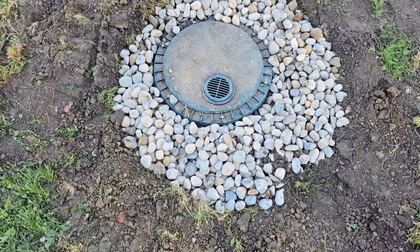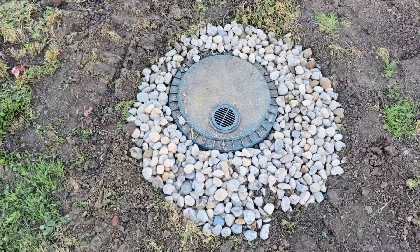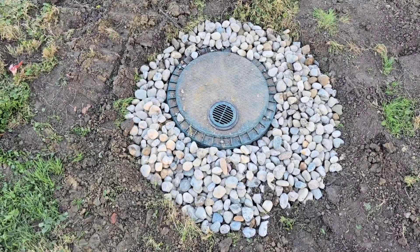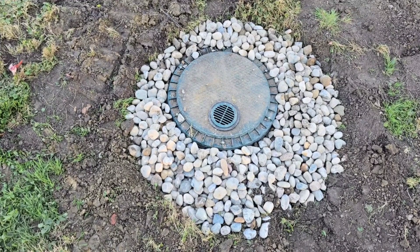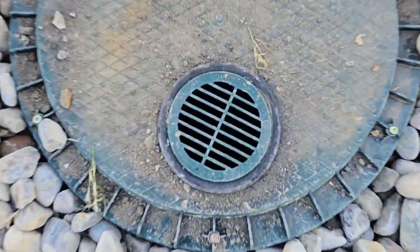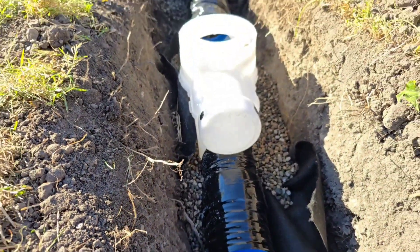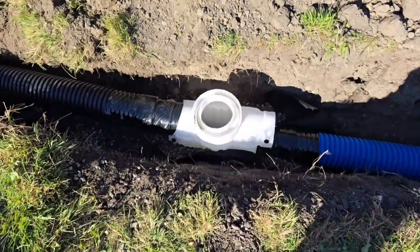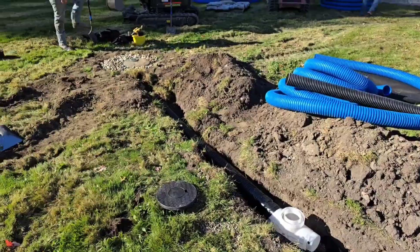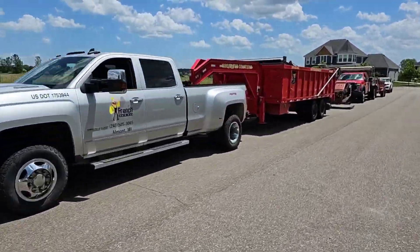This is our finished product — an 18-inch dry well that's 48 inches deep with big inch-and-a-half rock around it. As it fills up with water, it's going to run out the perforations into that big round rock and get absorbed into the subsoil. If we have days of rain and the subsoil is saturated, it'll percolate up through the stone. If we have torrential rains and it's full, it'll vent right here. If you're doing downspouts to a dry well and you follow all the details in this video, you will have success. Make sure to have that septic box to catch all the contaminants, use a good non-woven geotextile filter fabric before you put your dry well in, and also vent your dry well. If you found this information helpful, give us a thumbs up. I'm your host Robert Sherwood, and until the next video.